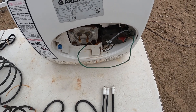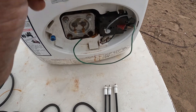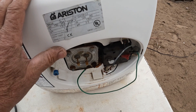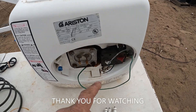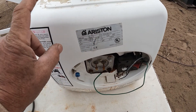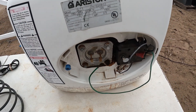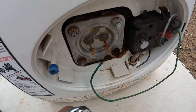I had this hot water heater running directly on solar panels for over a year. It finally started leaking, I took it out of my house, and it burned up the switch because it's an AC switch — you can get these in DC also, so you can convert these to run directly off of solar panels. Another gentleman had a list of where you can get these switches and I'll see if I can find that if anybody's interested. It worked great — I just hooked right up to these connections here, positive and negative, and it heats right up. It's the same as this, just wired up a little different with a different connection.